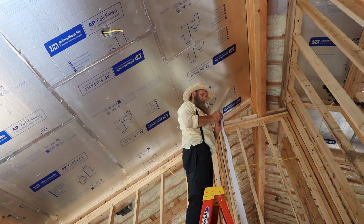According to code, on a 20 amp circuit you can get 10 outlets. That doesn't mean that it's either a light or whatever. They consider each box worth 180 watts.